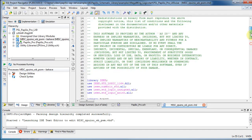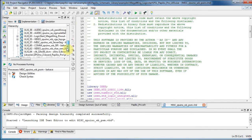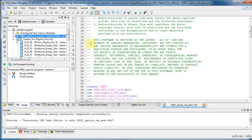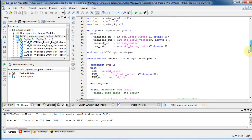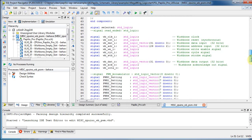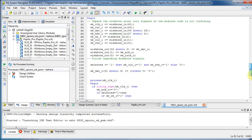So you can go through it, and there is a whole bunch of these examples. These are some of the ones I'm using, but there's even more examples in the directories. And it basically shows we just have a simple wishbone interface. I also have a clock, and I have this pulse width modulation out. So I have an 8-channel pulse width modulation system. And I've made a really simple pulse width modulator where I just copy and pasted it a bunch of times.